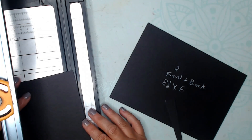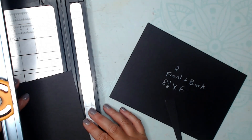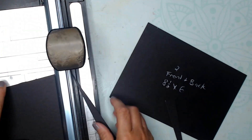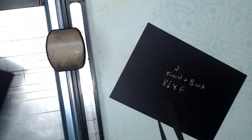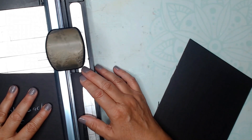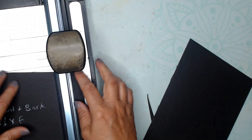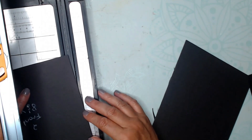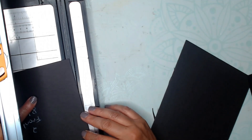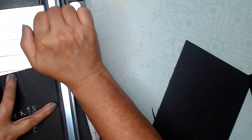Starting with the corner 8½ on the bottom and cutting it down to ¾ at the top. We'll do the same with the second one — just measure, put that little tick mark at your cutting guide, and cut down to nothing. I'm flipping it over and doing it from the 8½ to the ¾ of an inch tick mark at the very top.